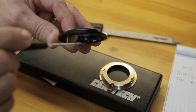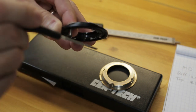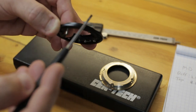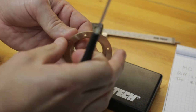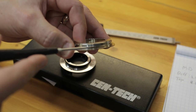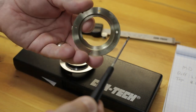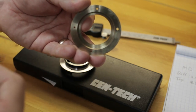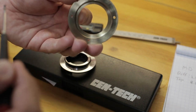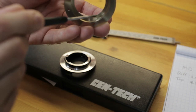Final measurements on the Minolta mount: this surface will be our reference. From the bottom to the top of this surface is 2.23 millimeters; from the bottom reference surface to the top is 8.08 millimeters. For the M42 to EOS, from the bottom to the top — which should not be machined — is 1.17 millimeters. The diameter is 60.7 millimeters, the inside diameter is 44.6 millimeters, and this thickness — since I did turn some of this surface out — is 1.2 millimeters.